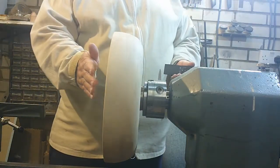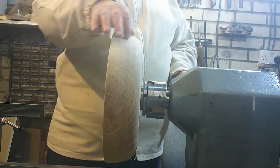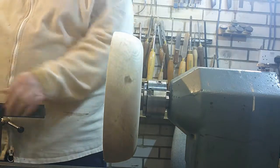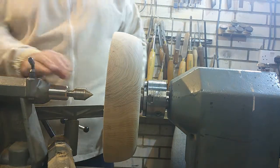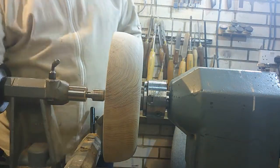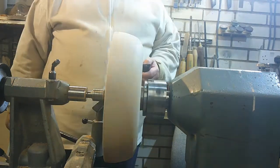What I'm going to do now is just hollow the bowl out on this side, just until we've got a nice uniform thickness on the wall, and the inside of the bowl should mirror the outside curve on there so we get a nice shape fruit bowl. The other thing I always like to do as a safety measure is keep a live centre — that's a live centre that revolves on bearings — up just for safety. So that piece of wood is squeezed in between the two of them, and if anything should happen it's not really going to go anywhere.